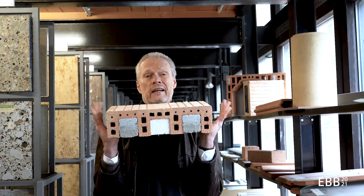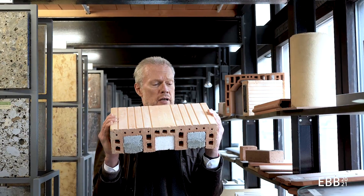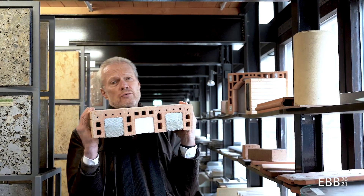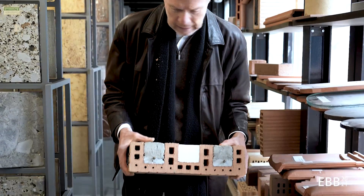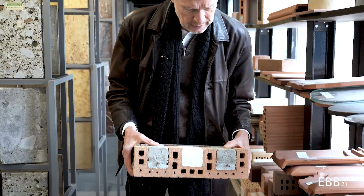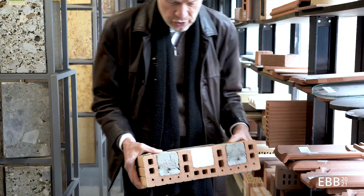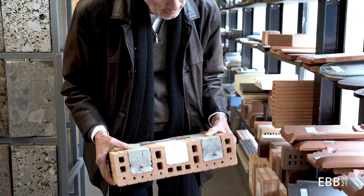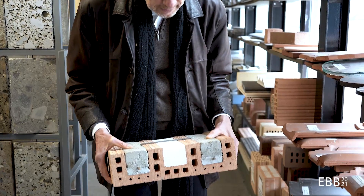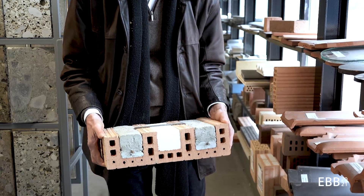You can see that they are the same width as the lightweight brick. And there are two concrete beams integrated, with tension being in the lower part. So that's where the reinforcement bar can be found. And in the middle, there's a styrofoam block to insulate the inside from the outside.